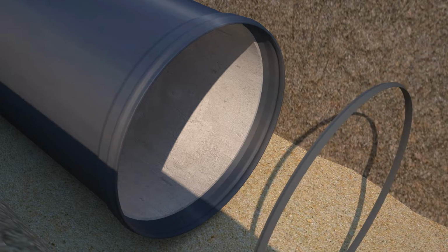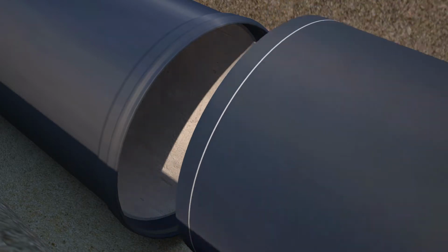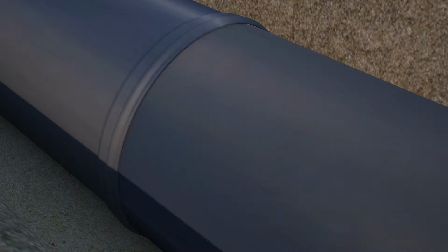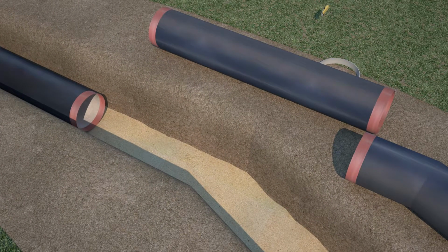A specified number of welded spherical spigot and socket pipes can be installed to meet the design requirements of the restraint provided by the surrounding soil, in accordance with the pipeline pressure rating. Once these pipes are installed, a special pup pipe is required, cut to correct size and installed. This pup pipe contains a welded spherical spigot on both ends.